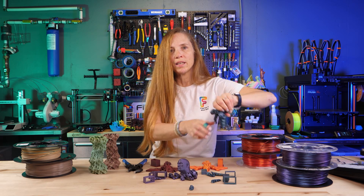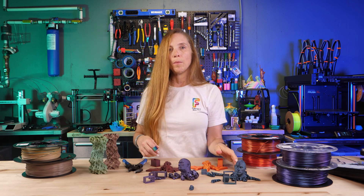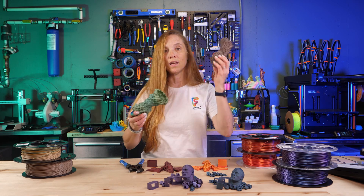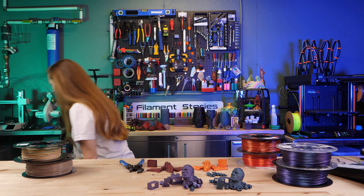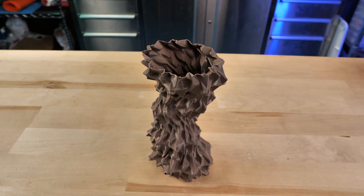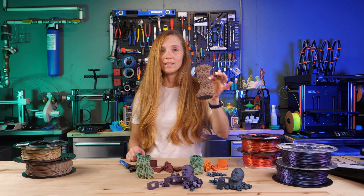It's still pretty strong — not tremendously weak. I would not have a problem giving this as a toy to a child that wasn't going to bash it. But there is definitely a difference. This is PLA with PETG and this is just PLA. I drop a lot of vases and they break at different points. A PETG vase usually does not break because it has some flexibility. We're going to see how they fare. I am not surprised at all that the PLA vase broke, and I'm not surprised that the one with PETG remained intact, because PETG has more flexibility to it — like your soda bottles, they have that squeeze and give. PET and PETG have that same level of flexibility. So while it might not have some strength, it does have some added benefits.